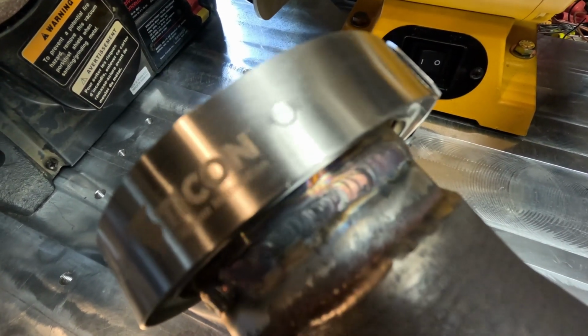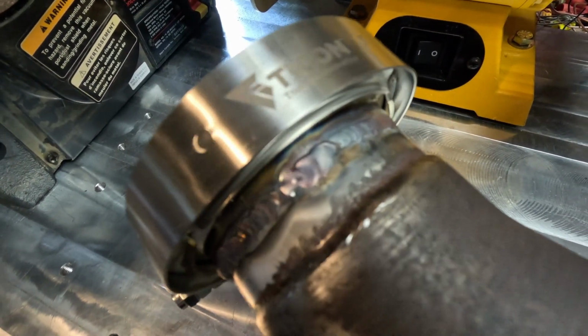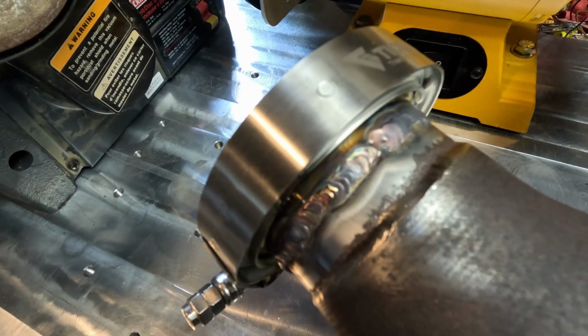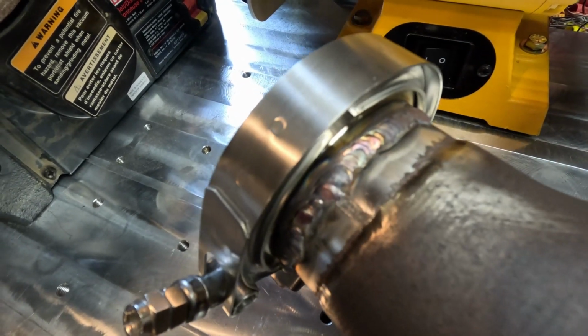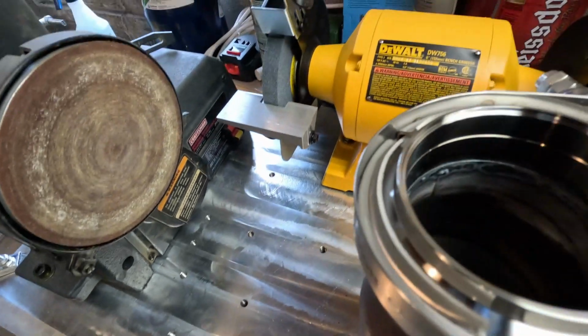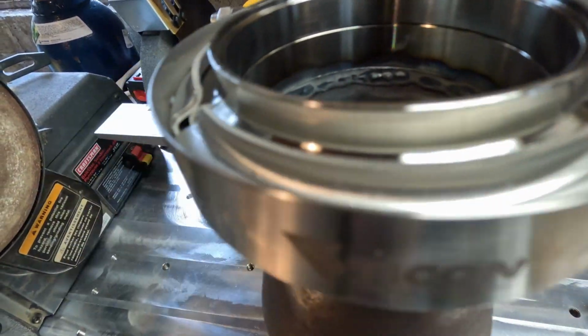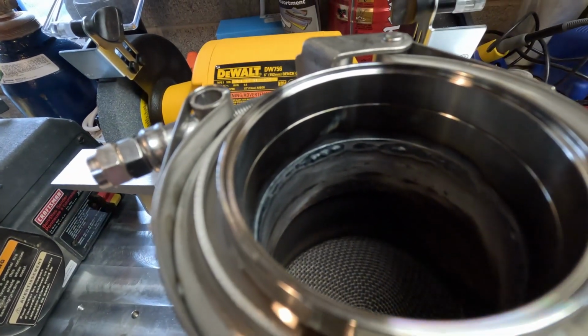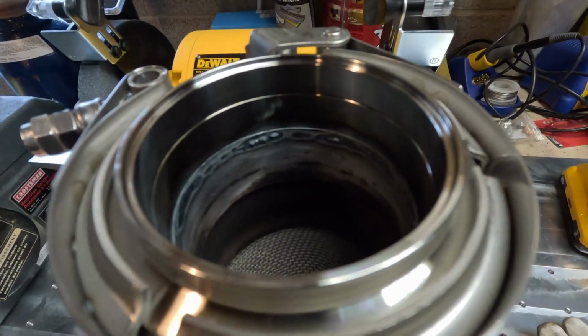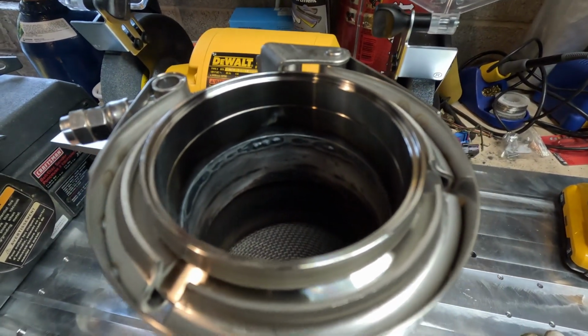There's a few spots that are a little shaky, and it took a little adjusting, getting used to having this V-band right against where I'd want to put my torch normally. But overall, they're good solid welds. You can see I got all this penetration on the backside, so I don't have any concerns about these welds falling apart by any means.